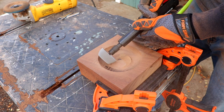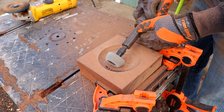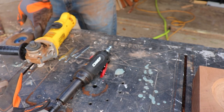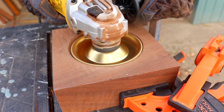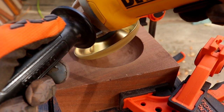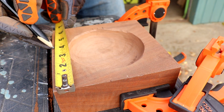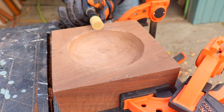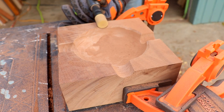I also wanted to try out their new contour wheels — it's probably not the best for this particular job but I have some great ideas for it in later projects. I switched over to the fine grit shaping dish to smooth the bowl out and do some more precise carving. Once I had the bowl roughed out I marked and switched over to a three-quarter inch rotary burr to create the holders for the cigars — it was just about the perfect size for the job. Light pressure for this; power carving definitely has some trial and error but it's fun to be able to freehand things.